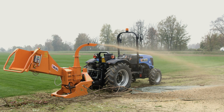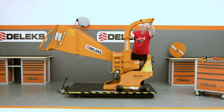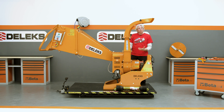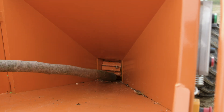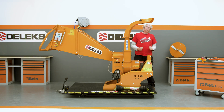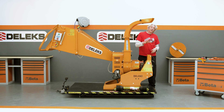It's a very useful way to change what's coming out of the machine, and the exit chute is totally adjustable as well. All of the plate steel is made from Swedish steel — high quality and very reliable. The machine is deliberately built very robustly, weighing about 430 kilograms, designed for farm use. You can move it with a forklift or on the back of your tractor, and it can be ordered with either category one or category two three-point linkages.